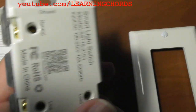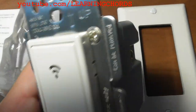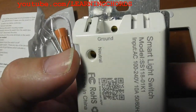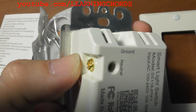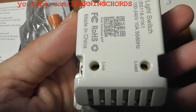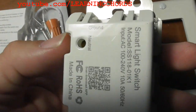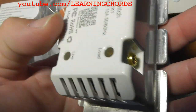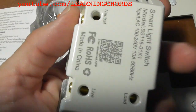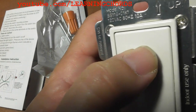Remember, this switch comes with a face plate, whereas most others require you to use only their included face plate. This switch also has screw connections on the back and on the side. A lot of other switches mandate that you use the wires attached internally — this one doesn't. You can put your wires directly into the back, which makes installation much easier. These are large switches, make no mistake about that.